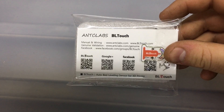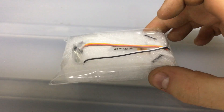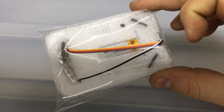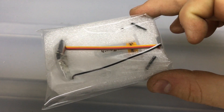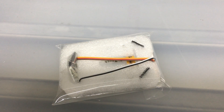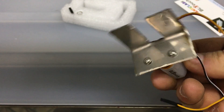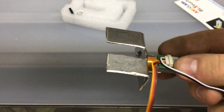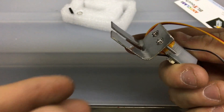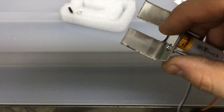This thing is going to allow me to do the full 5-foot prints. What's so special about this is the Z-stop sensor, or end stop sensor. I can do a bed leveling sequence that will allow me to dial in my first layer, otherwise half of the first layer won't stick. This way the printer can know exactly where to start the first layer so everything after that is nice and clean. I made a little bracket for it — just bent some sheet metal up, drilled some holes, cut a little slot for adjustability. It will be just a one-bolt holder, so the bolt goes right through the slot and I can move it up and down if I need to, to dial in where it needs to be.